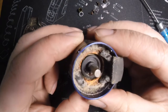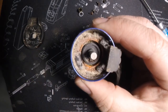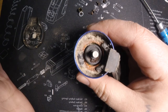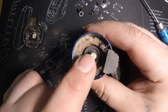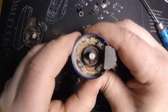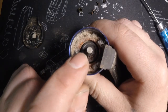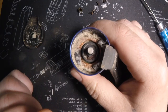I don't see any other washers on there, so I think we're at a good point to take out this center piece — I think it's called a rotor, but I'm not sure. This motor has strong magnets inside of it. This center shaft is going to be attached to that rotor. When you're trying to take it out, the magnets are resisting, so you can grab a pair of pliers — just be careful not to damage the shaft — and try and pull it out that way. I've had some success with that without doing any damage.